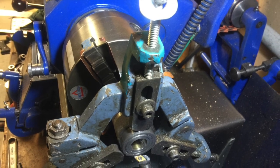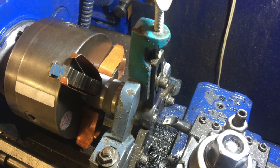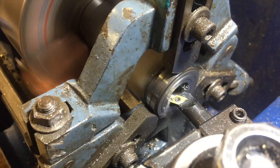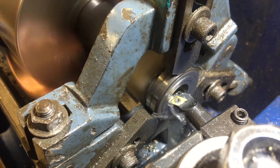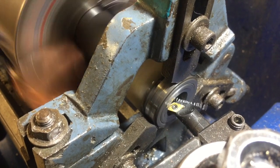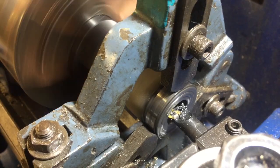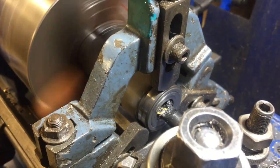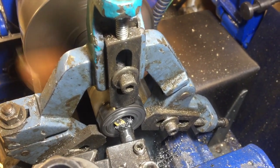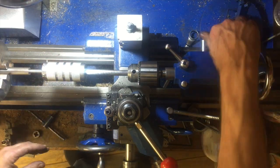Now the next stage is to make the actual holder cylinder. A friend in the Boxford users group gave me this fixed steady for the Boxford lathe — thank you Ross. This is the first time I made serious use of it and it's a very nice thing to use because it keeps the material exactly centralized and it's a lot easier to set up. This piece of metal was too big to fit down inside the spindle of the lathe, so it had to be projecting in front of the chuck — that's why I used the steady. I used it there to bore out the center of that hole and the hexagonal inserts go into those round holes. So that concludes this little project.